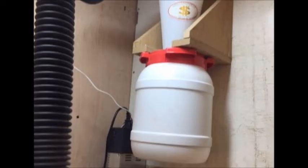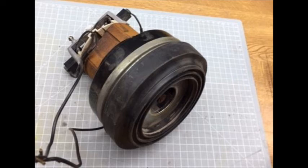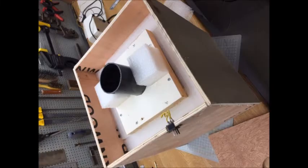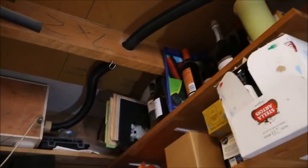Though the bin is only 6 litres, it holds a surprising amount of dust. As the domestic waste bin is kept in the garage, it is the work of a few seconds to empty it. I used a Henry type vacuum cleaner to begin with, but quickly replaced it with a dedicated system. The vacuum motor I used was from an old cleaner — you need the type that passes the air through the motor to cool it. If you cannot find one, they are available as spares on eBay. I mounted it in a box just big enough to hold it, then mounted that in a bigger box spaced off with elastic foam — the type you get in packaging. A pipe protrudes from each end for the connecting hoses. The inlet is fed from the cyclone unit, and the unit is mounted up high just outside the enclosure. The outlet has a hose leading to the outside world. Very little gets past the cyclone, but I do not want any of it in the garage, and neither do I want filters to clean or replace. It is very effective and much quieter than a shop vac.